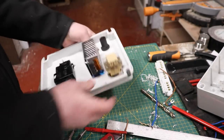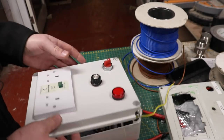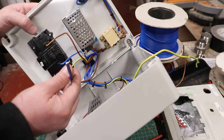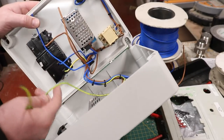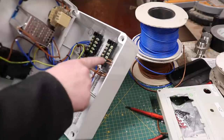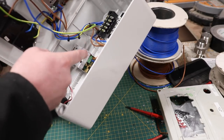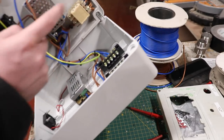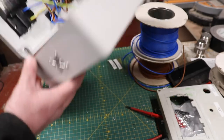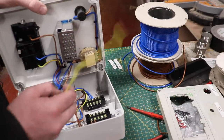Just need to wire the whole shebang up now. It's all connected up. Inside you'll see these two ends are the output for the heat lamps, and that's the earth that needs to connect to the earth on the main cable. I managed to find a couple of little bus bars, and I just need to connect the main power up to those. I also installed the 12 volt power supply, which is coupled into the on/off switch — so when the power's on for the heat lamps, the power's on for the supply, which rotates our little cooling fan installed at the bottom.